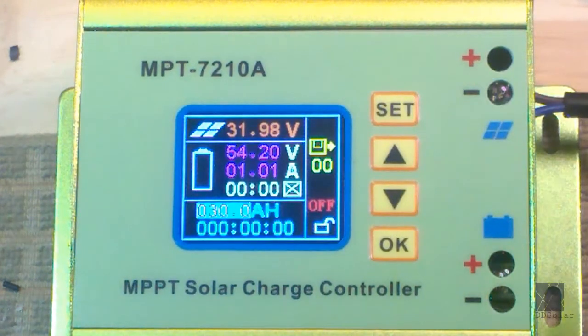Press Set and it's going to go into the amp-hour setting. This one is a bit tricky and finicky — it's just supposed to show the amp-hour settings of your battery pack. I made mine 30 amp-hours just to give me something. My pack is actually 60 amp-hours, but I'm never going to charge it all the way with this. So I made it 30 amp-hours so the little fuel gauge will have something to count against. It'll give me something to look at, though I don't really need it — but it is interesting.